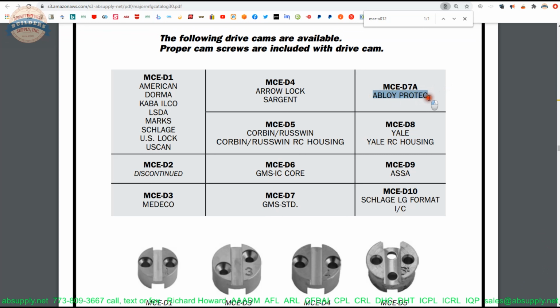This is an extremely dependable high security cylinder platform. Like no other cylinder that you've seen, it is actually more like a lock on a safe, in my opinion, than a pin tumbler cylinder. ASSA, since we're talking high security, would be here. That is like a Schlage Primus. And in fact, the same person who patented the ASSA patented the Primus, and of course vice versa. Very similar concepts. The same concept, just derived in a couple of different ways. Very ingenious, the ASSA. Very, very ingenious. By comparison, it'd be my opinion, the Schlage is less ingenious.